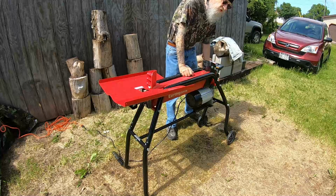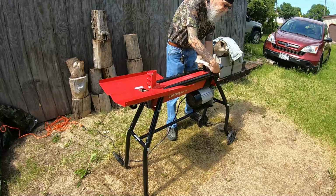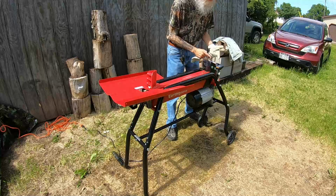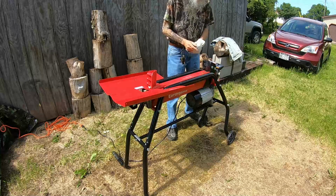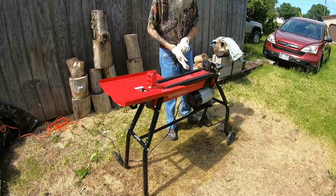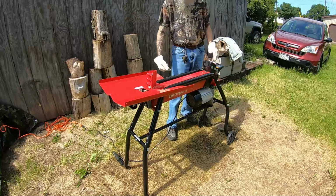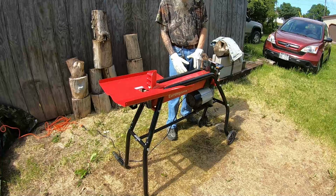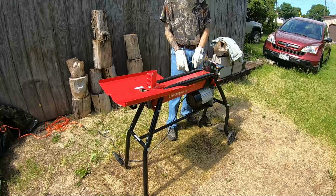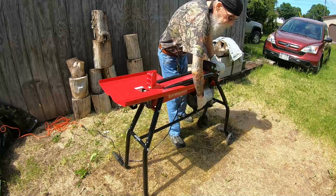There's a lever under here. It just goes up and down, and it pushes in a valve that triggers the hydraulic cylinder. Now, I can push that down all day and it isn't going to do anything. On the back side, there's a box that the power goes into, and a fuse. There's a fuse in it, and that's connected to this big electric motor.